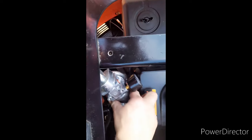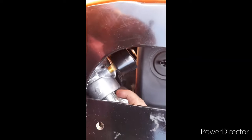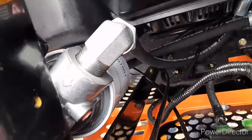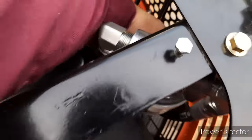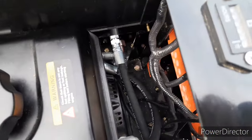Trying to find a home for this thing — I didn't put the pressure gauge on until after I was done playing around because I didn't want to break it. Now that I've got it in there in about the spot where it's going to go, right about there, I can put in the pressure gauge and see how it works. For my machine, when I pulled out this main hose, the wire harness was zip-tied to it, so I've got a zip tie here and I'm going to put that back on. After a lot of playing around, I finally got the filter in there. I can see my gauge — filter's screwed on as tight as it can go and all the connections are in. Now let's start her up and see if she works.